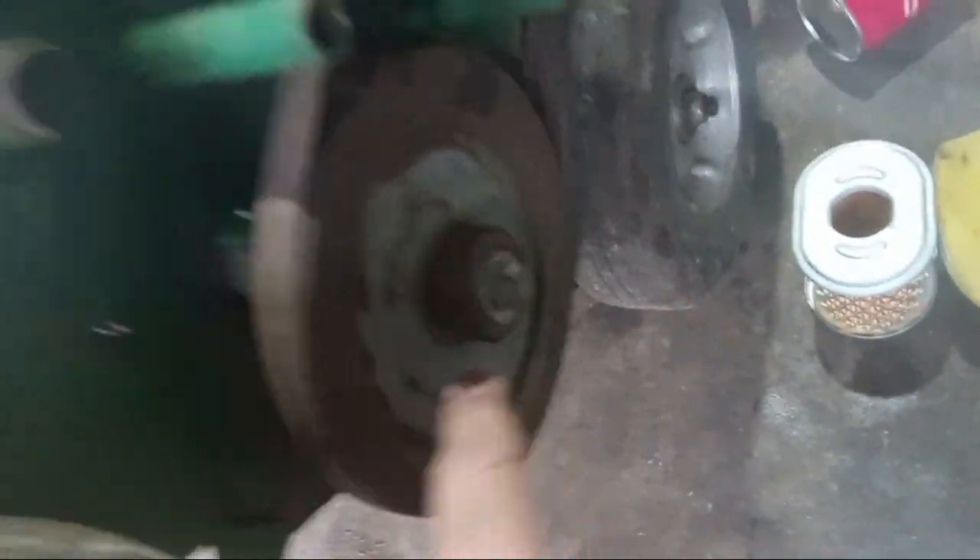I want to take a look at the blades underneath. Come underneath and check to make sure all your blades are there and none are missing. If you're missing a couple of teeth, you're going to have a wide strip missing in the yard when you're power raking. If you are missing teeth or have damaged ones, you're going to have to remove this bottom pulley on each side, remove this cover — there's a bolt here, bolt there, and another one in the back — which will let you bring this assembly down. You can see how they're spaced out with two spacers between each one. Drop that shaft down and slide the teeth back on; buy new ones.